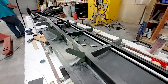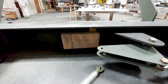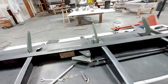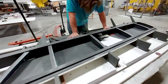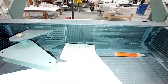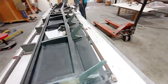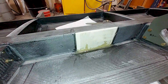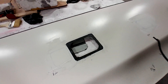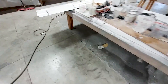This is some FR4 that Jeff has had to bond in to reinforce the spar because of the hole that goes through there for the push rod. Engineering on the fly — the hole had to be quite big. Jeff hasn't even cut that hole yet but he's put the FR4 in preparation for it. This is just to strengthen the spar because putting a big hole through it makes it not quite as strong, and that FR4 will also get a layup over it to strengthen it further. Here you can see the opening for access to the bell crank — the flange is in there now so the little cover panel has somewhere to mount against.